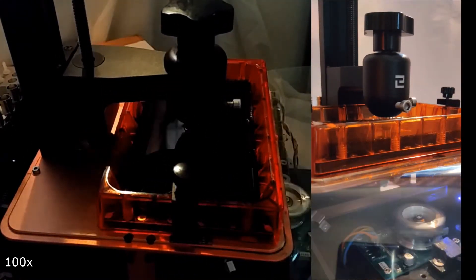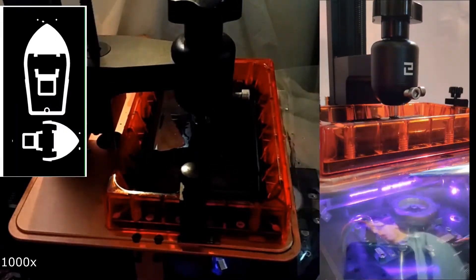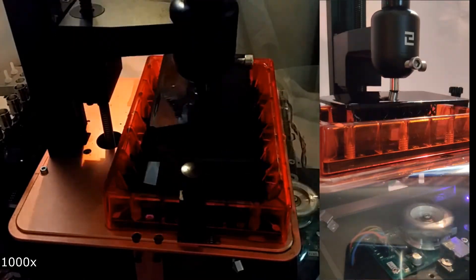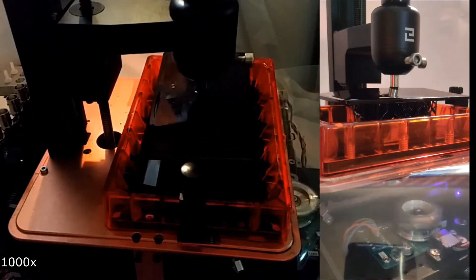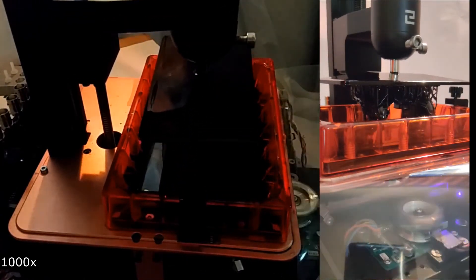The scan data have a spatial resolution of 20 micrometers. The printer is controlled by an STM32 dual-core microcontroller. Two-stage movements are required to cure a 50-micrometer-thick layer. A single layer requires 11 seconds, which corresponds to a print speed of 17 millimeters per hour.